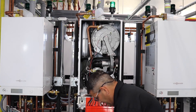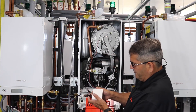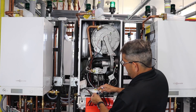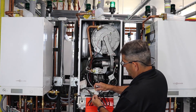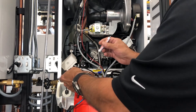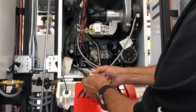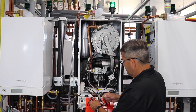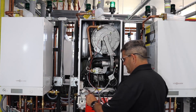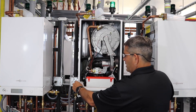Once we put our wires back together and put our new sensor on, we put the cover back on the boiler and put our sensor wires back on terminals 3 and 4. Remember, small screwdriver. Always pull on your wires to make sure they're tight — that's a little trick. Same with your wire nuts: give them a little tug to make sure they're in there good, because loose connections can cause headaches down the road, especially on your line voltage.